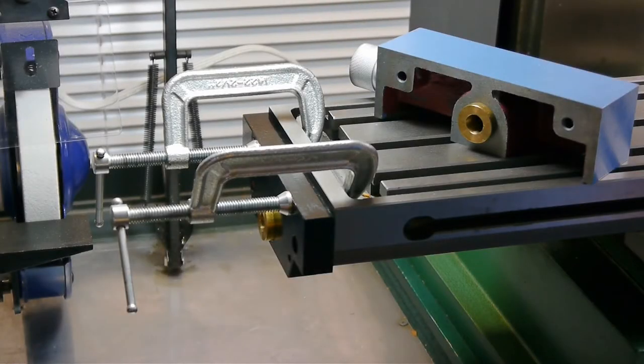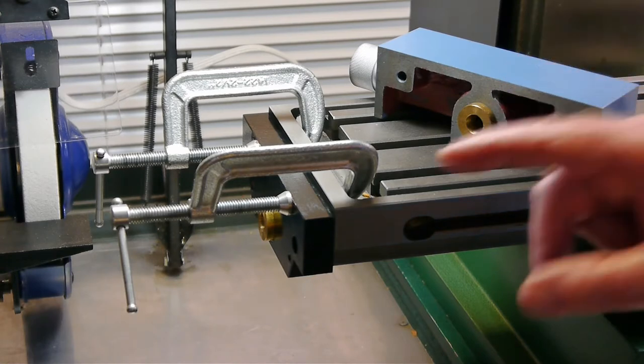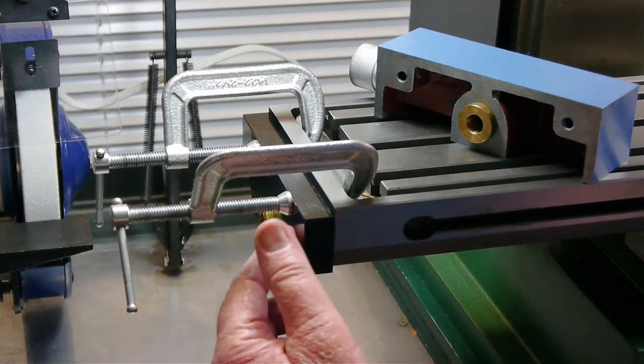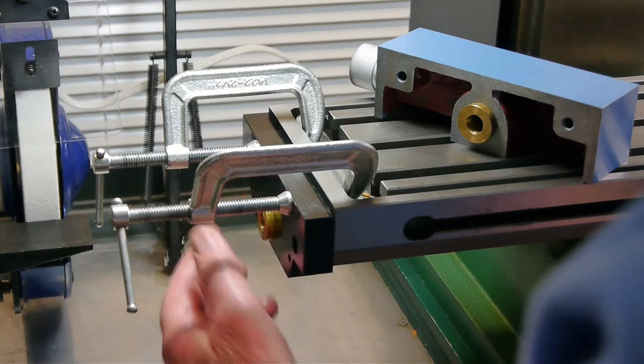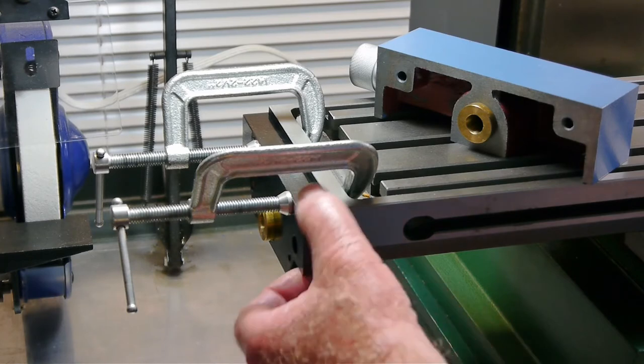As I noted, the original table did not have an end plate, so I needed to get one. I got one from Grizzly, which was in fact for the G0619 SX-3 mill. It has to be put on the end in order to locate the screws so you can drill and thread them to have the proper location to engage the lead screw. This provides the appropriate spacing and also allows you to mock it up and test the fit by moving the table back and forth across the mill and trying different positions of the end plate.